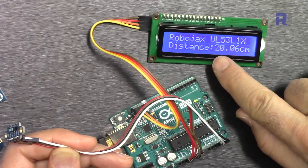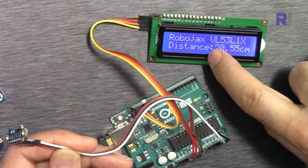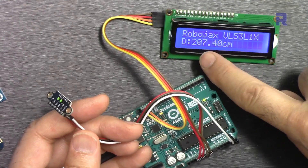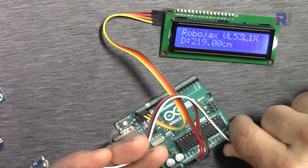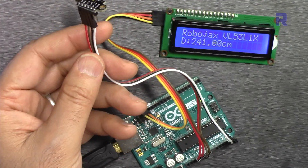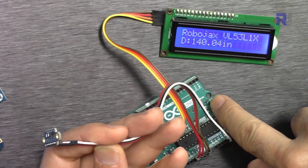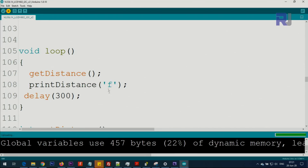In centimeters with long mode, the 'C' and 'M' labels get cut off on the display. For that purpose, I updated the code to version 2 — instead of the full word 'distance' it just shows 'D', giving enough room for the values to be displayed. So that's almost 4 meters — 380 centimeters. With 'I' for inches in long mode, it shows everything properly with all digits and characters. For feet, type 'F'.